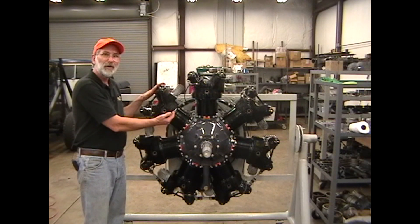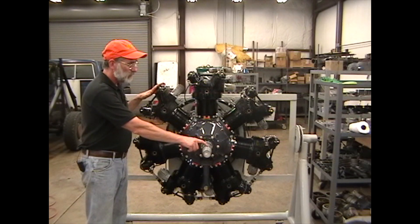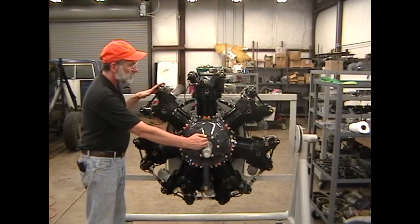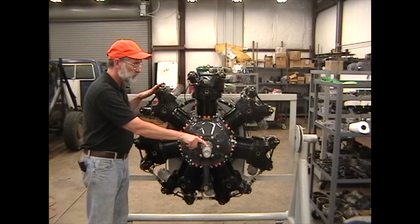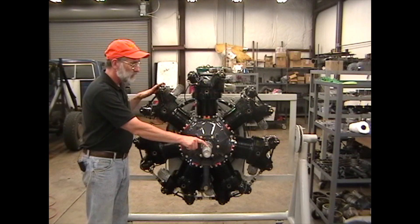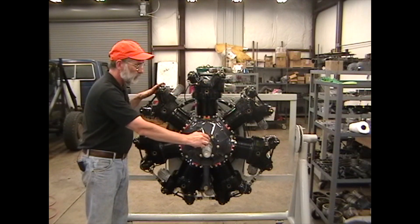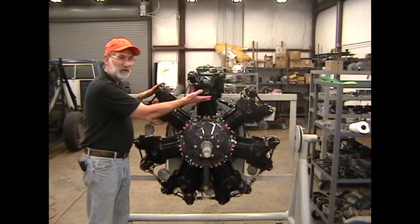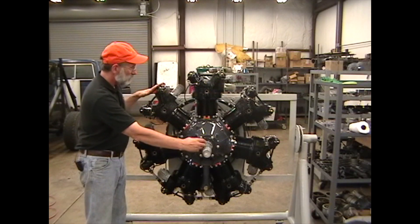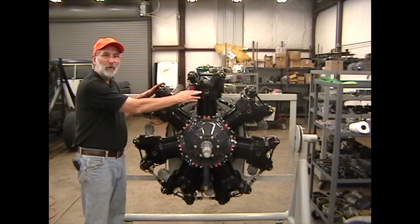So we want to make sure the piston is at top dead center when we begin to remove the cylinder. How do we do that? The crankshaft has a blind spline, and by blind spline we mean that spline is the one that is always pointing towards the piston that is at top dead center. Right now this spline and this pin — which is actually a screw on a Continental engine — is pointing at the number one cylinder. Number one is at the very top, so when that blind spline is pointing to number one, number one piston is at top dead center. If we rotate that around a few degrees, it'll be pointed at number two and we'll know that number two is now at top dead center.